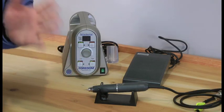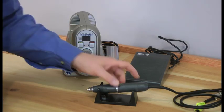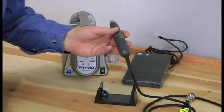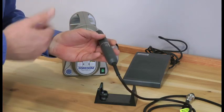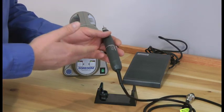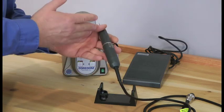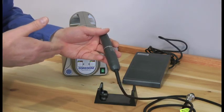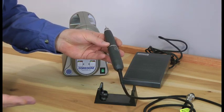Let me tell you a little bit about brushless micromotors. The difference between brushless micromotors and the other type — the type with motor brushes — is that you'll never have to replace the motor brush. That also means that these are sealed. There are no fan ports or dust ports, so it keeps the dust out of the components so they don't wear away as fast.